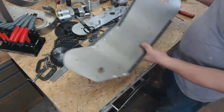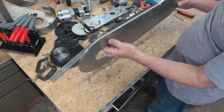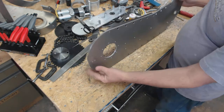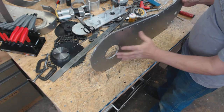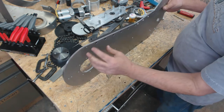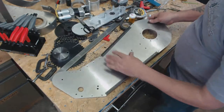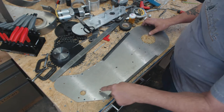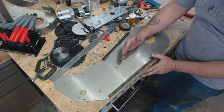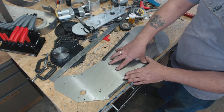Guys, I hope that helps you out. Now I have all the holes needed in both plates at once. The reason to do both plates at once is very simple — it doesn't matter if they're out five or ten thousandths as long as they're equally out. If I did these individually and tried to drill these holes, they may not be exactly symmetrical to each other. When I sandwich these together, there's no possibility of error — the holes are where they are on both plates. So the eccentric drive won't have one side that's slightly higher, lower, forward, or back. All the holes are in the same location, so these particular plates are forever a set.